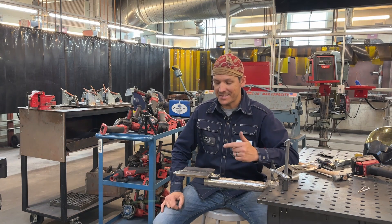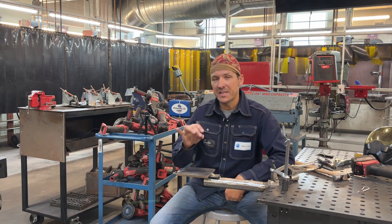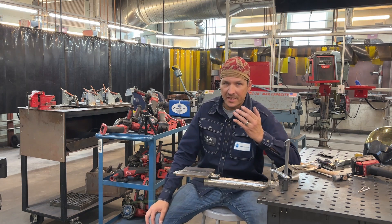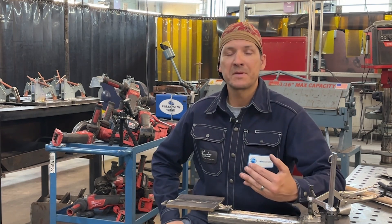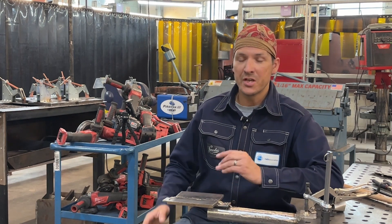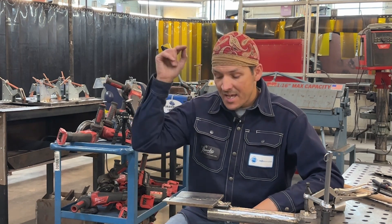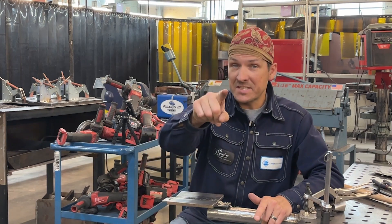That was your 1G spray transfer MIG CWB structural plate test. We're going to bend this in a different video. The number one reason people fail these tests is not skill — it's nerves. People don't practice, don't warm up, or don't prepare properly. So breathe, make sure you can pass this, do a couple bends. Listen to your inspector — follow the direction, follow the procedure. Your hold points and stops and restarts must be followed at all times. I hope you enjoyed this. Let's do another one on the horizontal coming up next. And as always, keep those lenses clean.